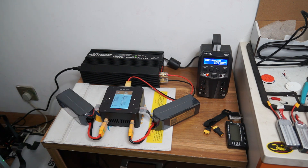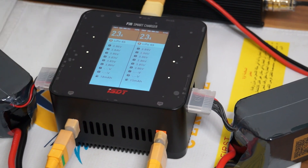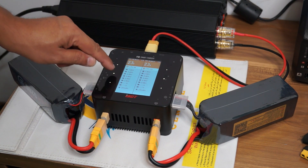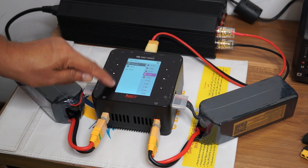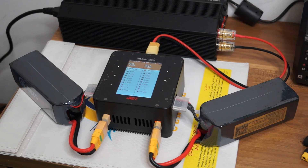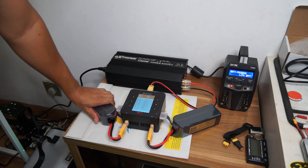The fan is not running at the moment — air conditioning is on in the room. Zooming in, the charger is drawing 2.3 amps per battery. These are 5000 milliamp batteries so I can always increase the amps — I'll go ahead and set the current to 5 amps. Now approximately 10 amps total are being drained and we'll see if the power supply heats up. I'm sure it's getting enough juice to charge these batteries.